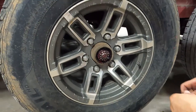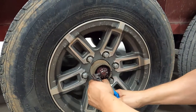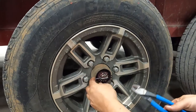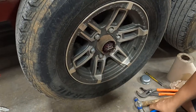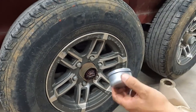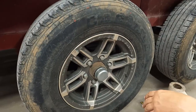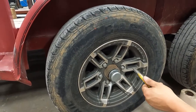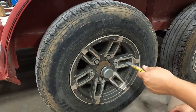Then we're going to replace the cotter key. The cotter key has two different lengths — always put the longer end to the outside. I like to leave a little bit of that tail and just trim it off. Then we can replace the dust cap. We're going to put a new dust cap, and at the end of the video in the description, we'll put a link for the dust caps and the various sizes depending on what size axle you've got. I'll also put a link for a dust cap install tool — though I'm going to show you the chisel method again since that's the most common. Just slowly begin to walk it around.